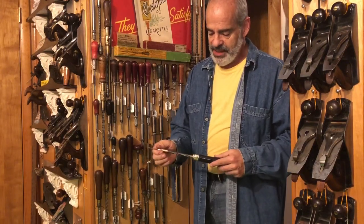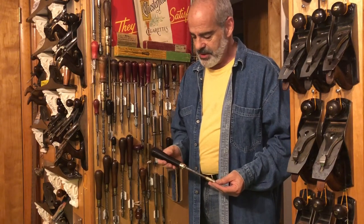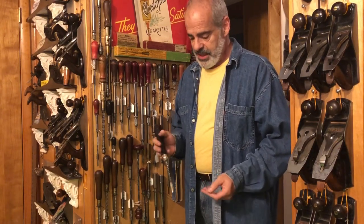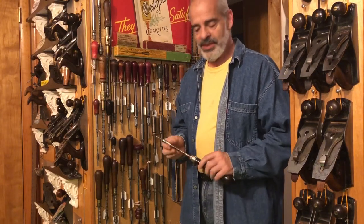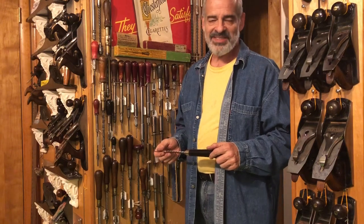I hope you got something out of this session. I'm glad to have this back functioning again — plenty of spring in it — and it's not a very difficult repair. Anybody can do it once you know to remove the screw first, then unscrew, and then get to the middle portion. They're easily cleaned up, handsome tools, and they work extremely well. When you see these at yard sales, buy them — they're very good functioning tools you can fix and bring up to snuff. They're really great for starting a hole for a screw instead of using an awl or gimlet. I hope you enjoyed the video — please subscribe and come back again.